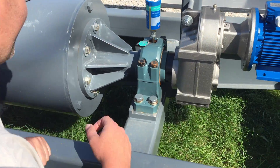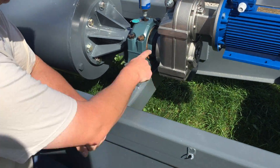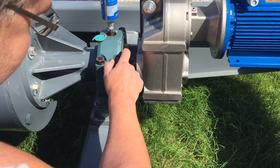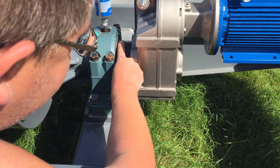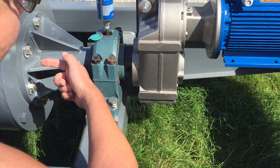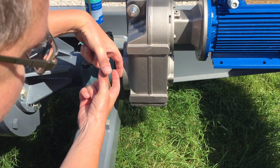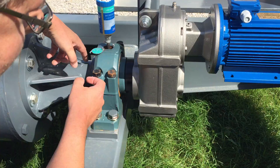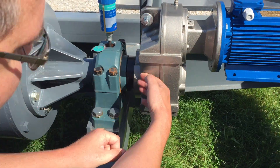The seals are inside the flange — you can't see them from the outside. In front of the upper bearing you can see this black device, which is a retaining collar. This retaining collar puts the complete thrust load of the screw into the forged inner piece of the upper bearing, not the cast outer piece. This keeps the screw from falling out. The way it works is this piece slides off, and there are two half collars that go around the shaft into a groove, then this outer piece slips on top of them.